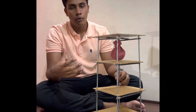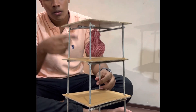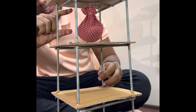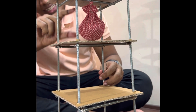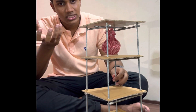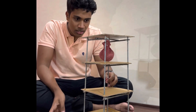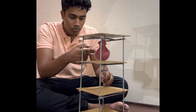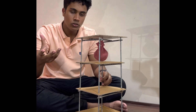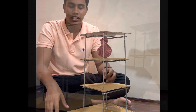Another very important component of our earthquake resistant model is the tuned mass damper. The length of its suspension is a critical parameter, as is the mass of the tuned mass damper itself. When the building shakes, the tuned mass damper moves in the opposite direction of the building, reducing the momentum transfer and inertia transfer to the building.